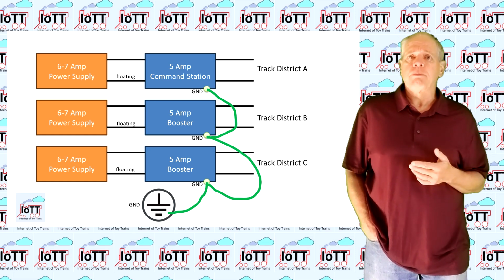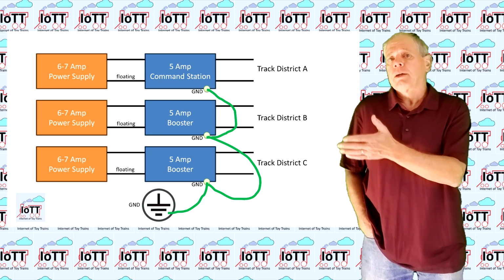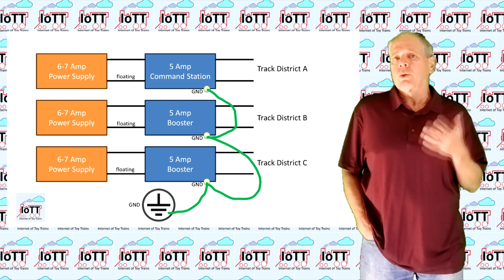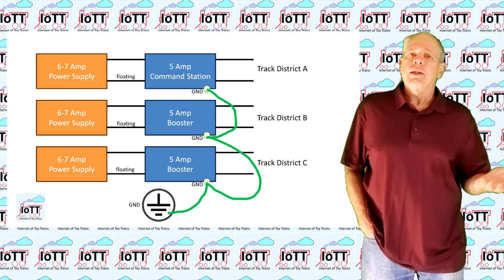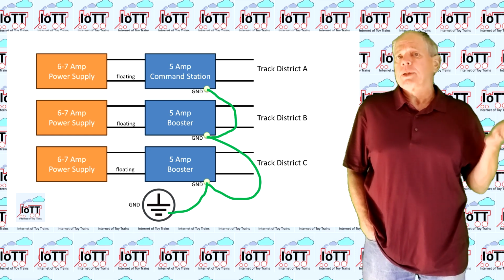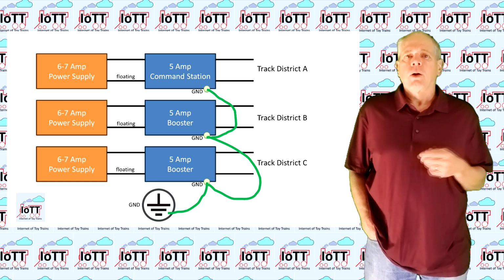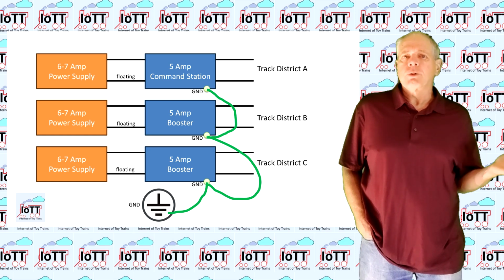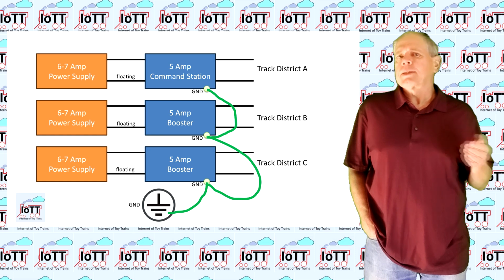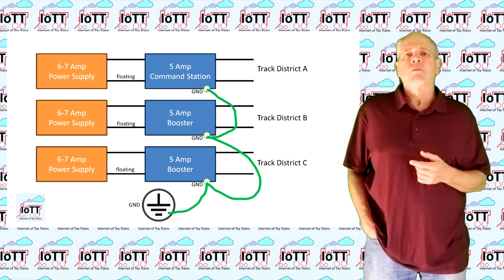This ensures, for example, that the locomotive can cross from one power district to the next without problems, or it makes it possible to use an auto-reverser to change the polarity in a reversing loop. So, if you have several devices, you should run a wire between them and connect the ground contacts of each device to it. On Arduino-based devices, that would be the ground pin or the negative pole of the power plug, which is the same. On commercial devices, you typically find a ground terminal somewhere.